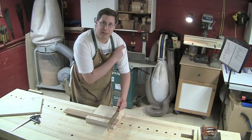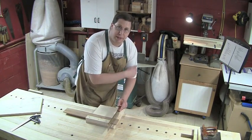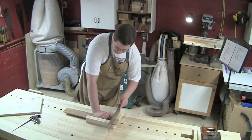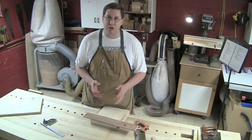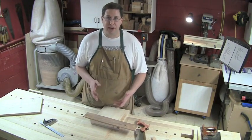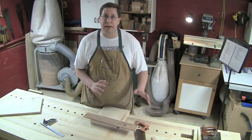If you notice, my arm is actually at an angle here. If I lean over a little bit, now it's 90 degrees straight up and down. This is the angle you want to focus on when you're cutting at the bench. If the saw is sharp and the saw is straight, it will cut much faster than you can make it cut. So just take deep breaths, take your time to get it established square and straight, then get out of the way and let it go.